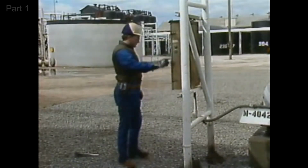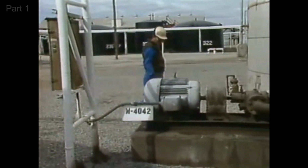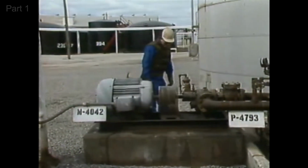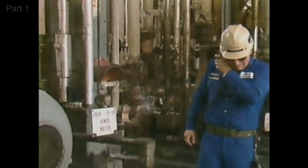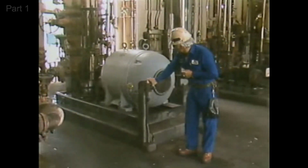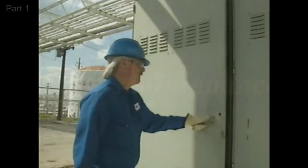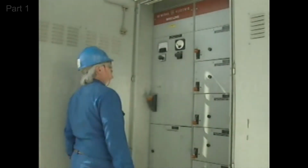When a manual controller is used, an operator must be at the location of the motor controller in order to operate it. An operator must be at the location because the push button or switch of a manual controller directly controls the flow of current from the power supply to the motor. A manual controller is usually located near the motor it operates. This way, an operator can make sure that the equipment is operating properly and can take action to correct any problems that occur.